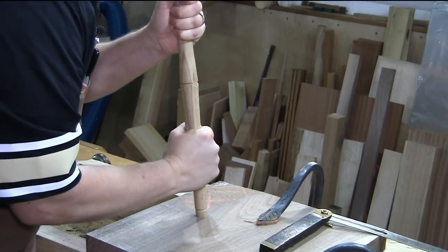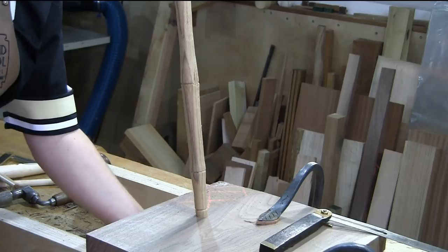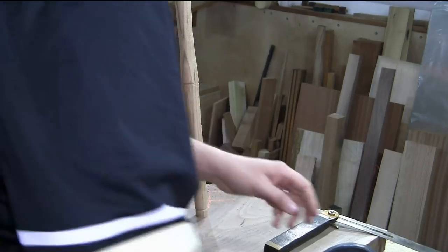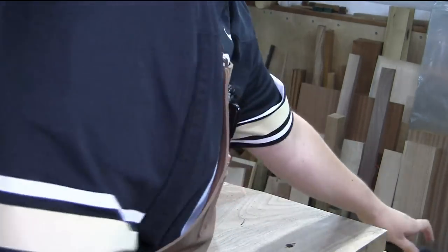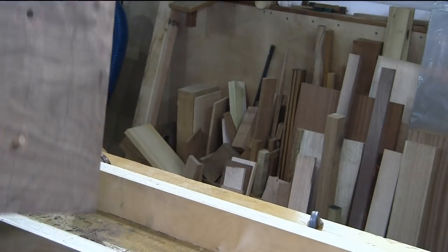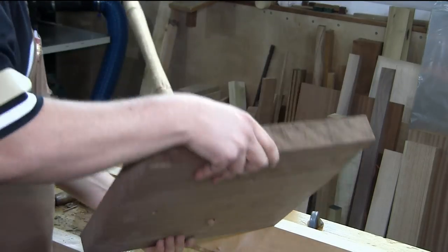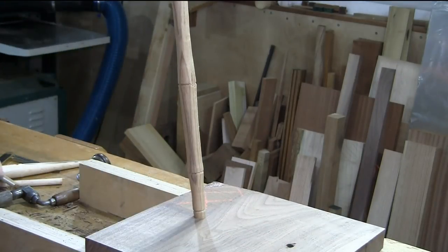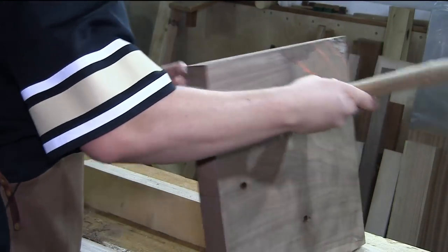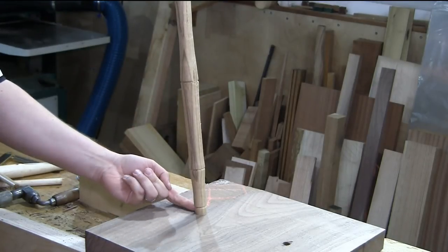See, this is awesome. That's what I love about Windsor joinery, that thing is so rock solid. That taper just comes and locks up. And I've got about a quarter of an inch of projection there. I think I want to go a little bit deeper here. Actually, no, I don't. I like that just the way it is because I've got enough sticking out and I don't want to go down to this first knuckle.